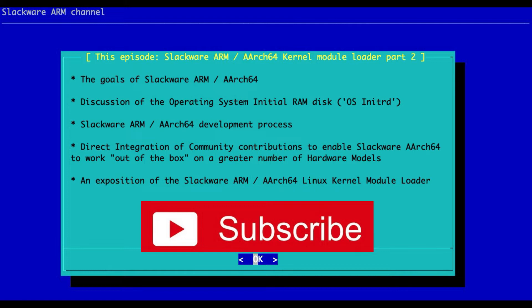I'm wondering whether it is something to do with grounding on the serial adapter, because I did read on the forums that people seem to have issues with grounding. I do have some of those serial adapters on the build infrastructure which has similar issues with grounding. Maybe there's something not quite connected right. The other two RockPro64s are perfectly fine — I haven't touched them, haven't had to do a single thing with them.